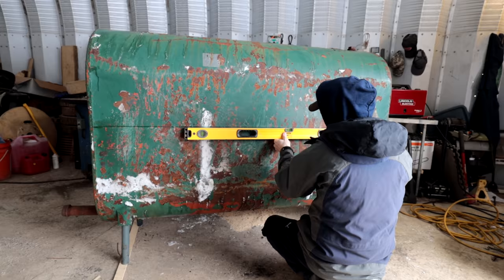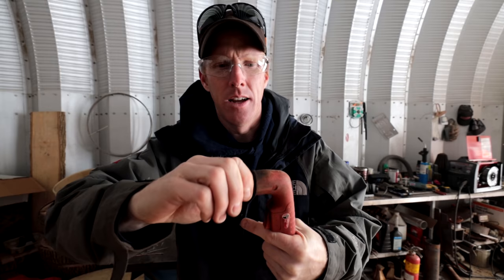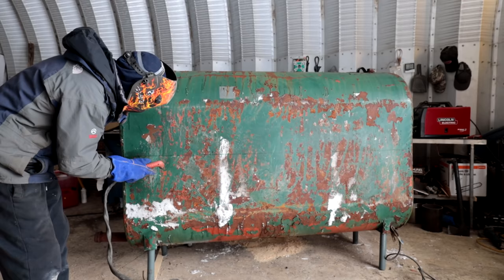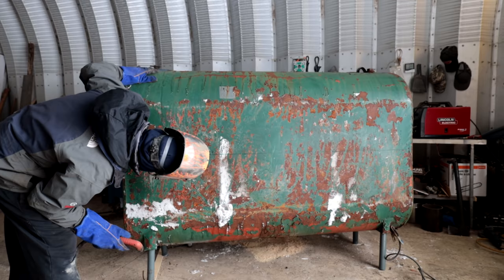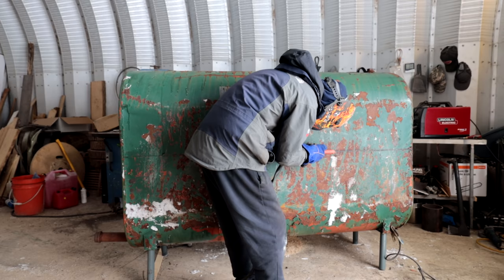And I think the dirtier the material you're cutting also affects the amount of life. So you can buy these. These are consumable, like I said. But yeah, it uses electricity, it forms an arc, and then there's air that shoots out of this little hole here, and it blows the slag out, cutting your material. So it's very efficient, easy, doesn't hurt at all. You just gotta wear your appropriate eye protection, just like any kind of welding. So plasma cutter, that's my cool tool.